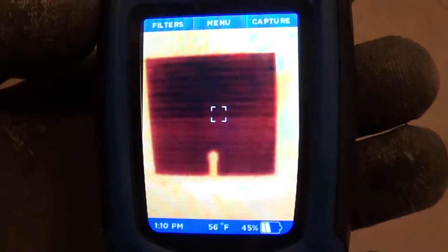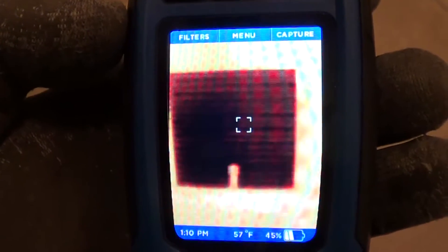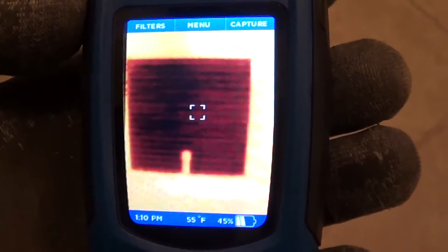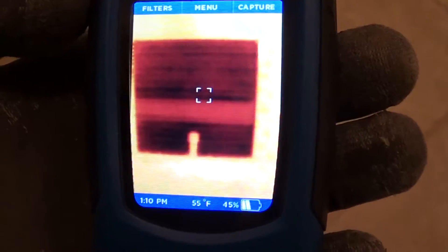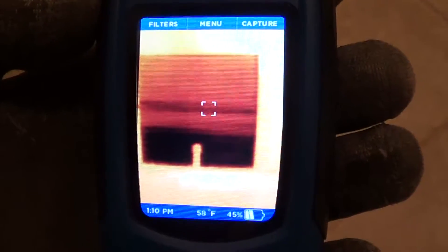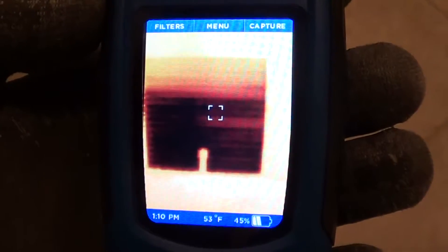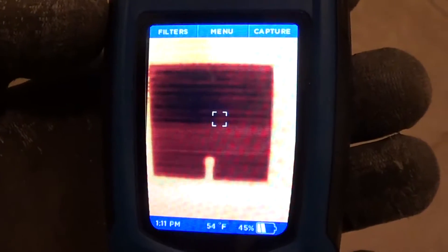So the whole coil is cold. You get some flood back condition under this. The valve just pinched off on the lower circuit, and you can see it on the top circuit too. Now the valve is opening back up. You can actually hear the refrigerant.